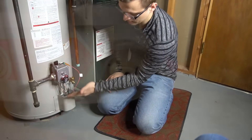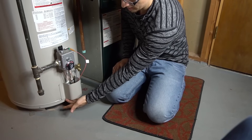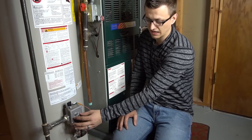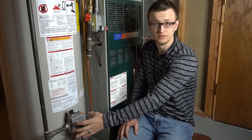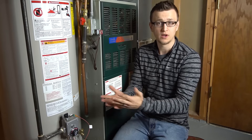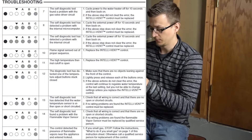The sensor is on the very bottom, underneath the burner and that burner tube that goes down into the burner chamber, right on the bottom right here. Most of those water heaters, the gas valve will have some kind of LED light that will be blinking some kind of a code, or it'll be just a solid code. A lot of times there will be a sticker somewhere on the water heater that explains what that code means.